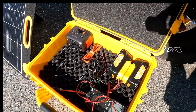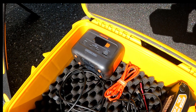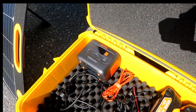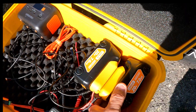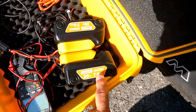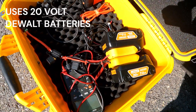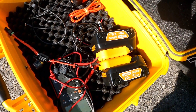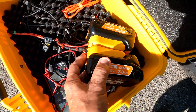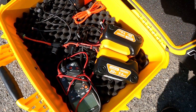Here's a small kit we just put together. The smaller Jackery we'll look at in another video — it's a USB-powered connection device only, but it's small enough to carry in your backpack. What we're recommending is something like this unit, and we'll go into more detail on it. We're using an aftermarket 7 amp-hour, 20-volt battery, and that will run the Starlink Mini for a good six hours. If you manage it carefully, you could easily get a couple of days in the field. This is a great setup for a disaster team or search and rescue team — they could take six to eight batteries and just swap them out as needed.